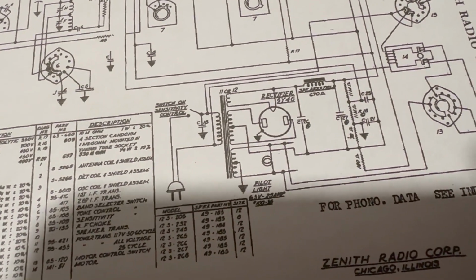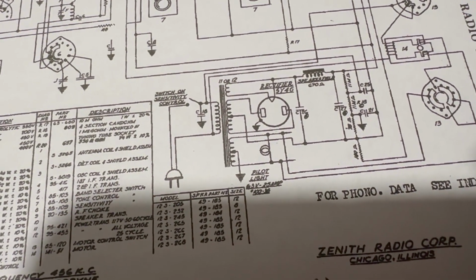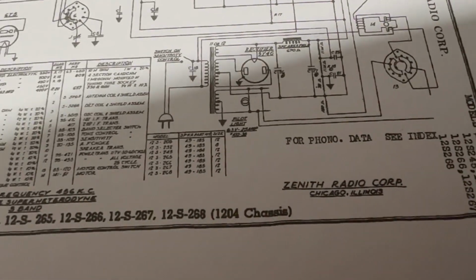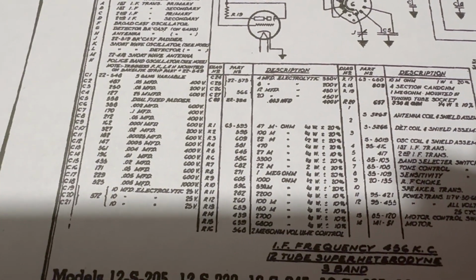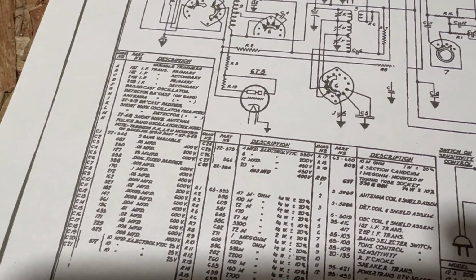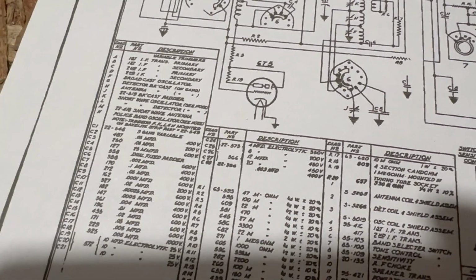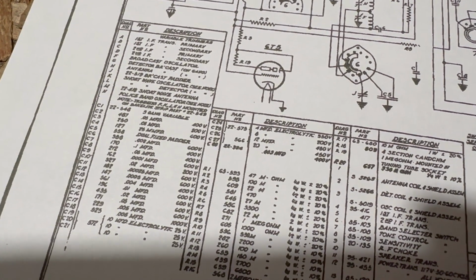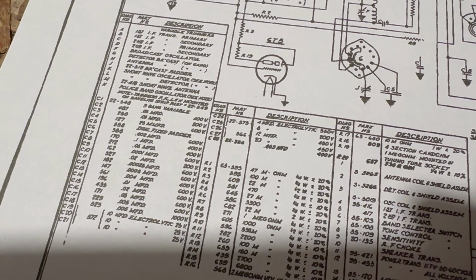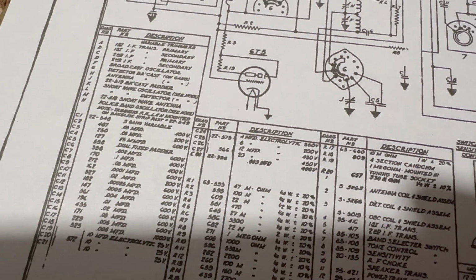These capacitors are very old, and unfortunately we need to change them. This is marked 40 microfarads. Well, if you look at the schematic here, there's nothing even close to 40 microfarads. So, I hate when people do that. So that's marked 42. Well, there's no capacitor marked 42. There's C20 through 27 or whatever, which are all electrolytics, and they're all low values.